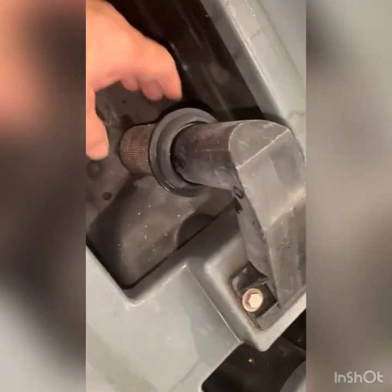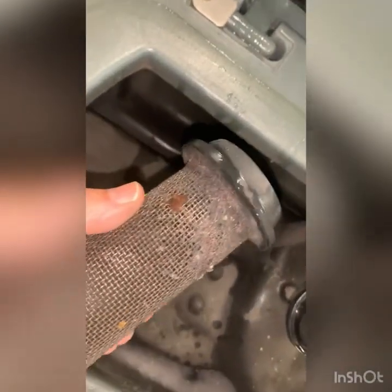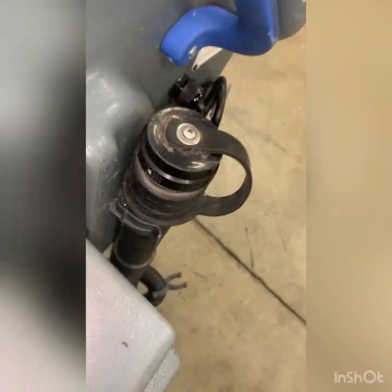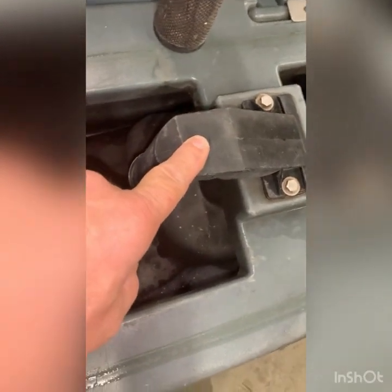I have a couple other findings. Looks like we have a decent gasket for the lid, that's fine, but I'd like to see them leave it open so we can get some air into the vac motor area. They should also be cleaning this — they'll get more water lift if they keep it clean. Instead of just dumping from the hose, rinse it with hot water. If you don't have a high pressure hose, just get your hand in there with a scrub pad and keep it clean. Then run the vac motor for a couple minutes to get all the moisture out.